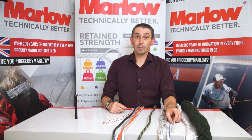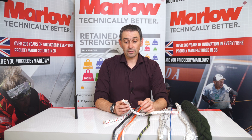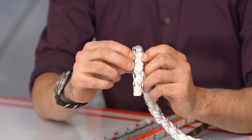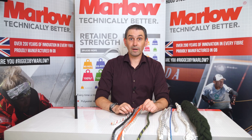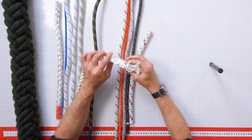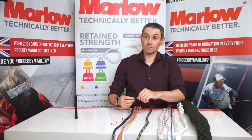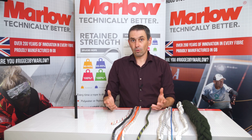Sometimes the markers are there to denote the material the rope is made from. Unlike some of the other things I've talked about, this is industry standard and relates back to ISO standards. Inside this rope there is a little green thread running through the middle — that green thread denotes that it's nylon. So if you ever find a rope, regardless of who made it, with a green thread in the middle, that rope should be made out of nylon. Likewise, this polyester rope has a blue thread running through the middle, which denotes that it's made out of polyester. There are also similar different colours that denote polypropylene, polyethylene, or other materials.